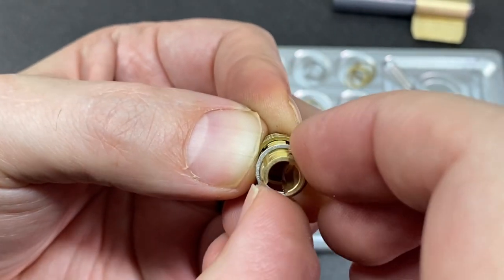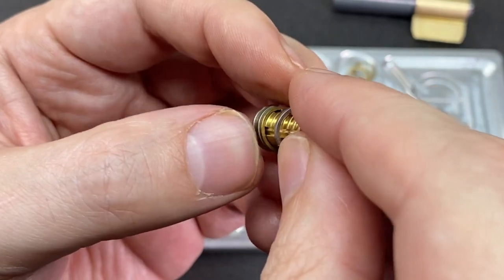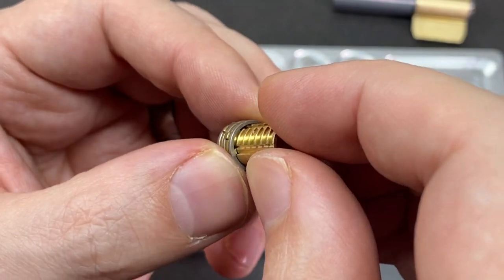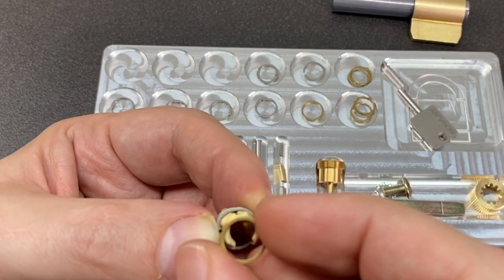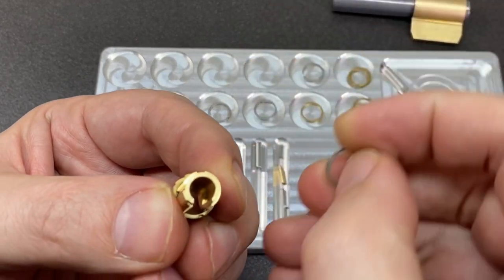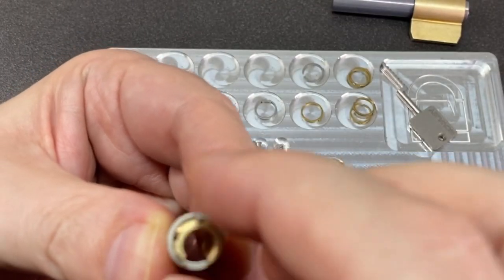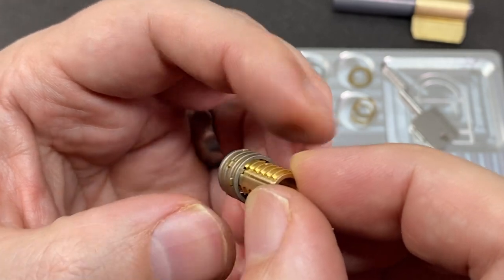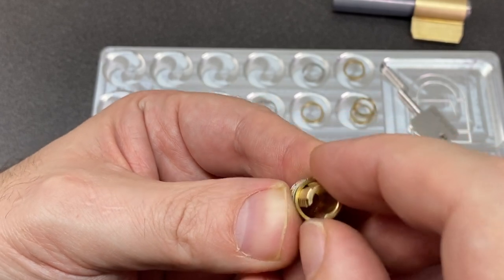I hope this works — that I did pull them out in the right way — all the way down to the bottom, and rotate it around to the side. Then the next spacer, then the next disc with its tab, all the way down. Basically what I'm doing by rotating it is locking that tab in so it behaves and stays in place.